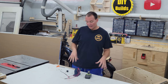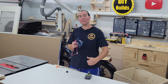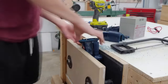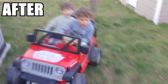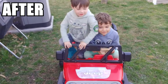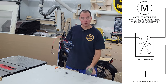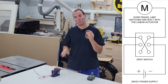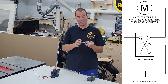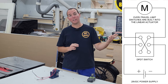Here's the contingency plan: we're going to be using an old Ryobi vacuum cleaner that I cut the end off — you might remember this from my Power Wheels upgrade video. That Power Wheels kind of died, so we get to use this again, as well as my Ryobi battery. Here we just have a little rocker switch — a two-position, two-pole switch — and this is going to reverse the positive and negative polarity, allowing the linear actuator to spin in one direction and then the other.